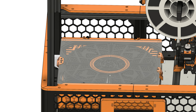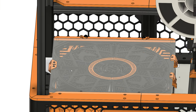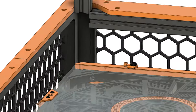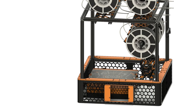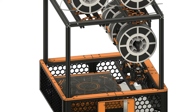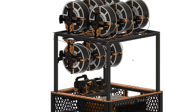The reason these skirts are so tall is because of the Nevermore Max air filter here. The top panel of the Nevermore Max needs to open from time to time to replace the active carbon inside — there's a hinge there. I need the top acrylic panel to be able to open, and I don't have the joints modeled in Fusion 360 so I can't show it in action. I just needed to be able to fit my hand through and have enough room for the panel to swing open. The only way to do that was to make these top skirts pretty tall.